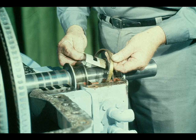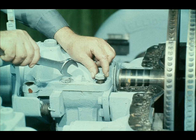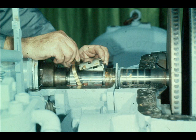After the cap is removed, the workman lifts the oil ring with one hand and slides the top half of the bearing liner out. He then labels the bearing with the word inboard so it cannot be confused with the other bearing. Next, we'll remove the outboard bearing cap, but before doing so, it will be necessary to unhook the speed changer tension spring from the bracket on the bearing cap — mainly just to get the spring out of the way. Then remove the cap screws from the bearing cap, lift the cap slightly, and pry the liner out. As with the inboard bearing, the workman lifts the oil rings and slides the bearing liner out. Don't forget to tag this bearing as outboard.